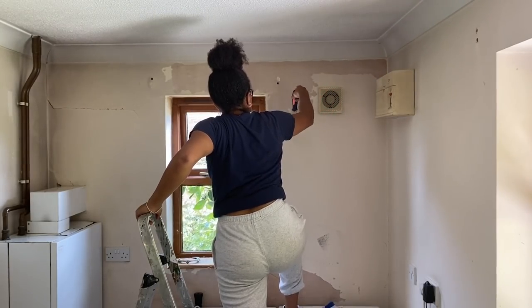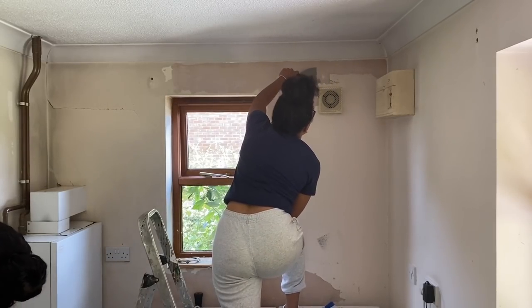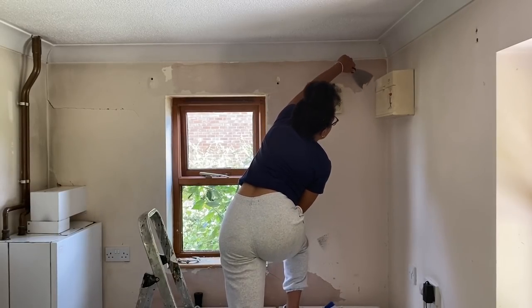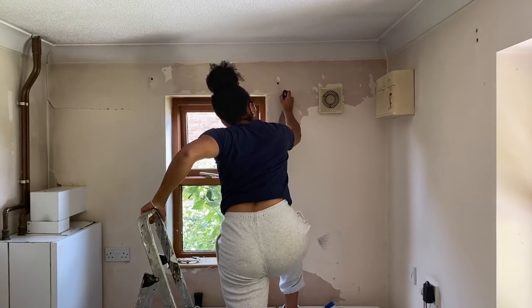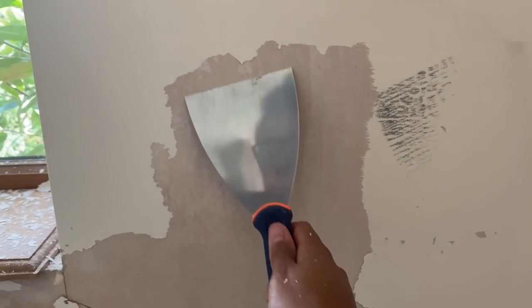I'm brushing all the walls down because we are going to be painting everything from the walls to the ceiling. The paint was coming off terribly — this is because of years of washing clothes, causing condensation, drying it out, and then all the paint just dried out and flecked off the walls. I didn't want to just paint over the horrible texture, so I used a paint scraper. It took me a few hours but it left a really nice finish.